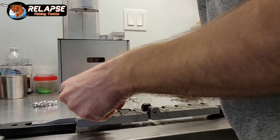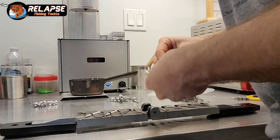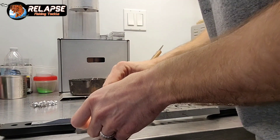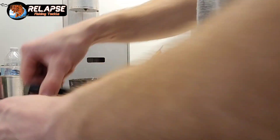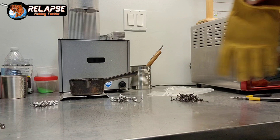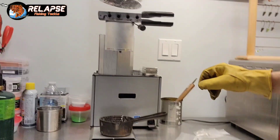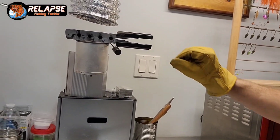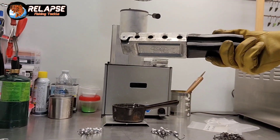Like I said, the hooks might need to be warmed up a little bit — sometimes you do have to slow down just to get things prepped. Even after doing the dry graphite, if you're still having that problem, you might need to just set them in there and let them sit for a little bit. I just put the mold back up on top of the Lee pot. Make sure your wood handles are sitting off to the side — they can scorch if you get them too close to heat.